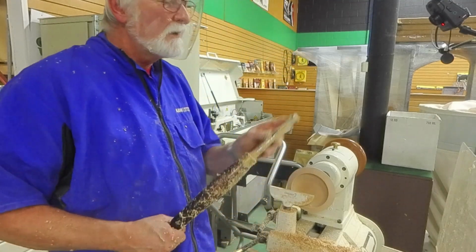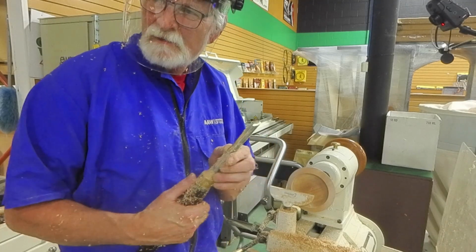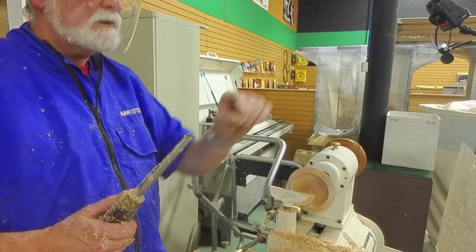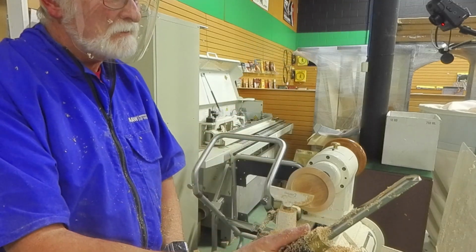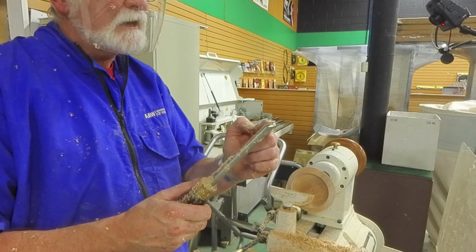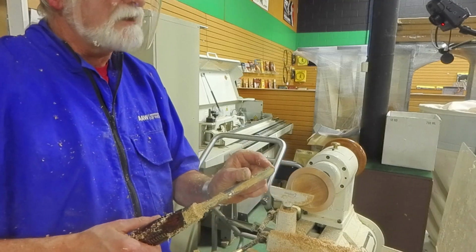It's the corner that these are a problem. So you always have a heel where you've sharpened this thing. I don't know if you can even see that, but there's always a heel on the bottom here. And when you're sharpening, if you've got a Wolverine, you can put a little spacer there, maybe 3/8 inch at the bottom of the thing, depending how you're doing it, so that if you've got a Wolverine and a Vari-Grind jig, it moves the jig ahead. When you move it ahead, then it goes to here, so you can cut a second grind just to get that heel off of there. Because when you're going around a tight corner like this, this heel starts rubbing, and that's not helpful.